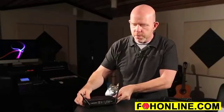This is the easiest to use wireless, and one of the reasons for that is because this is a full duplex wireless system. What that means is the transmitter and the receiver talk back and forth. Most wireless systems people have used before are what they call simplex — it's a one-way communication where the transmitter talks to the receiver. But in this system, we have data being shared all the time, which is very cool.